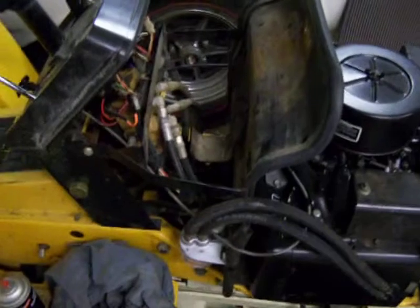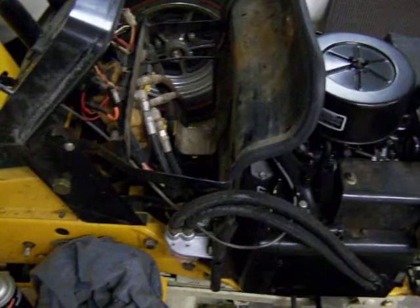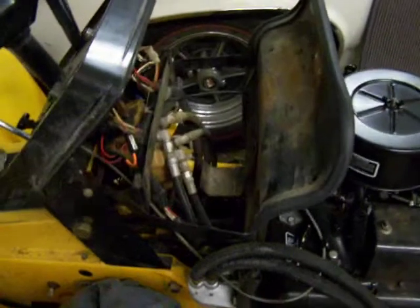I've been having trouble with the 1812. There's the gas tank. What happened was: when you turn the key, it has a PTO safety switch — if the PTO's on, it won't turn on. That's what it was doing. You had to mess with the PTO to get it to start up, then the PTO turned on and everything.